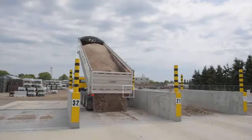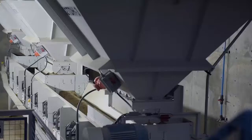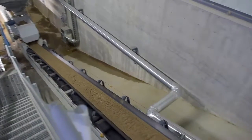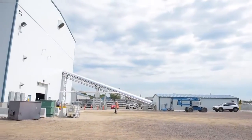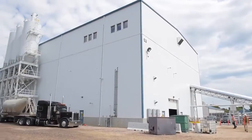To make concrete paving stones, the raw materials are first brought into the factory. Sand and small stones, otherwise called aggregates, are delivered by truck and dumped into outdoor receiving hoppers and then brought into the factory on an inclined conveyor belt. The cement powder is also delivered by truck but is blown up into large silos on the outside of the building.